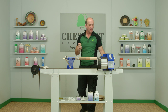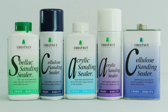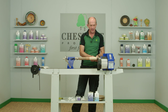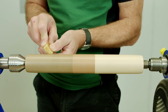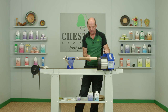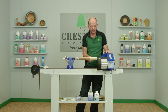We just pop that out of the tube. All the waxes really benefit from going on top of a sanding sealer of some description — this one's had the acrylic sanding sealer, but again completely compatible with any of the sanding sealers in our range. Wax sticks use the friction generated by contact to melt the wax onto the surface. As with all the waxes, you don't want to apply too much — so a fairly quick rub across there and you can see the wax going on. Grab a fresh piece of cloth and polish that up. This will give you all the benefits of the micro crystalline paste wax but in a quicker-drying stick form.